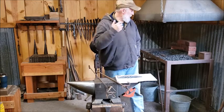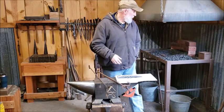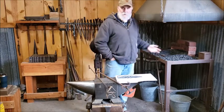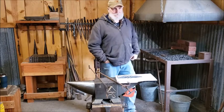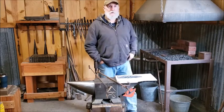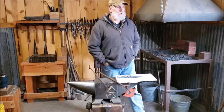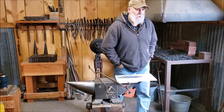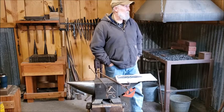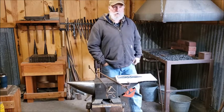This is a forge I made probably 20 years ago and it's been excellent. The plate in the bottom is a quarter-inch steel plate with a hole cut in the center for the fire pot, just welded together out of angle iron. Real simple, real easy to make. The fire pot is a Centaur Forge fire pot — they're between $500 and $600 now, which is astounding. That's going to be your biggest expense, but making a coal forge is really not that difficult.